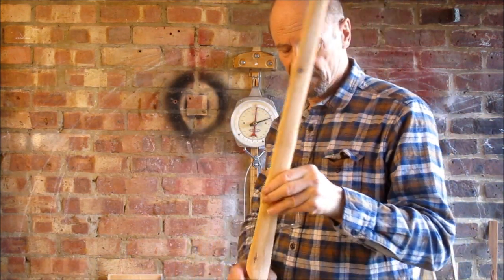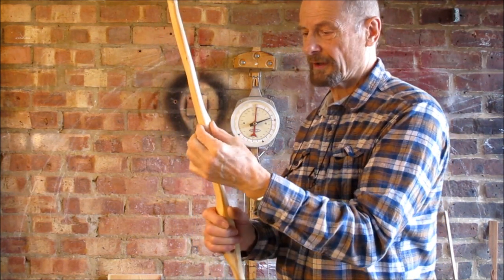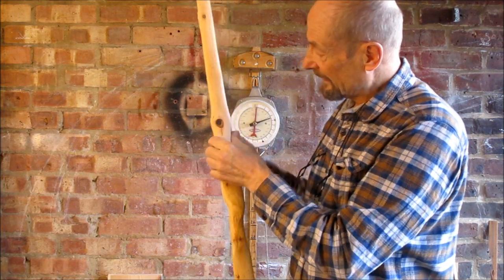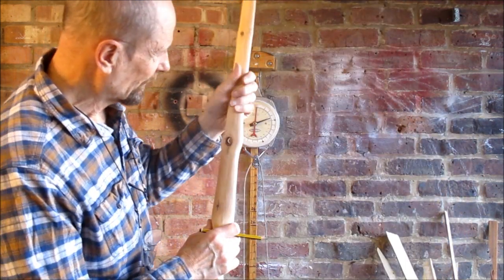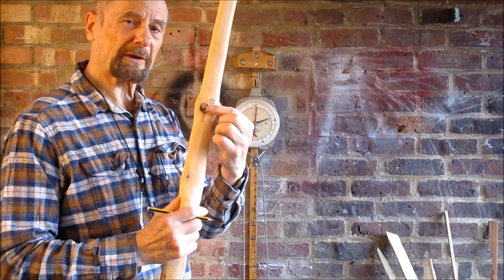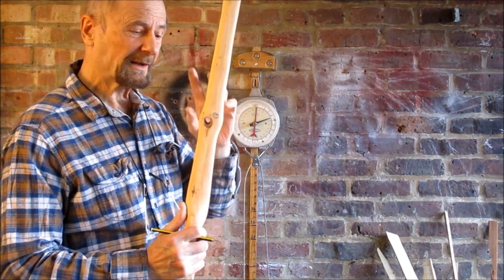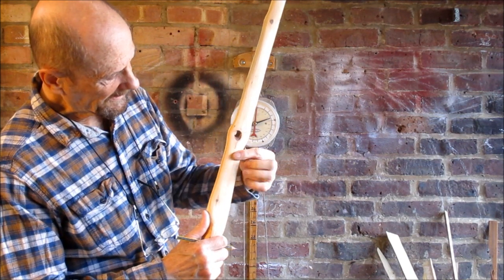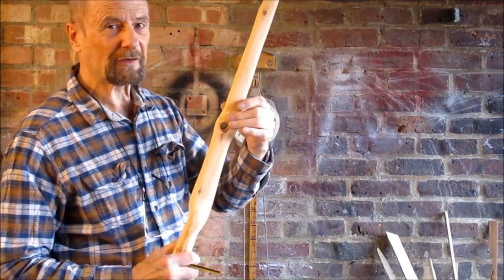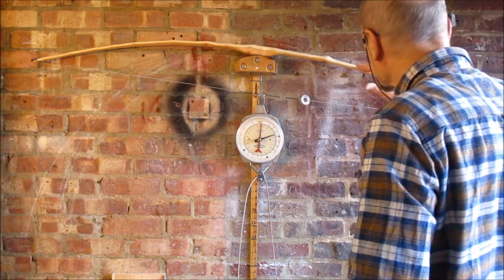It's difficult. I'm not going to do a lot — very little — but feeling it, that side feels quite good. This side you've got quite a lot of bulk; you've got the extra width on the sapwood and it feels just a little bit thick. I'll just file that off — I won't rasp it, I'll use a bastard file or cabinet rasp — just that whisker. I can feel it's thin there, swells up a bit there. Very, very subtle now — softly softly catchy monkey.